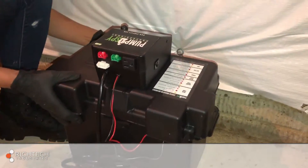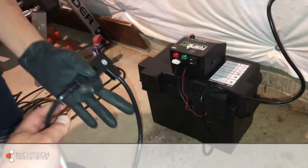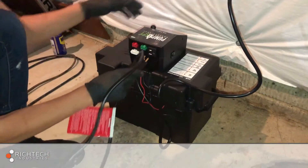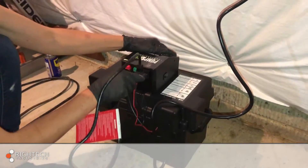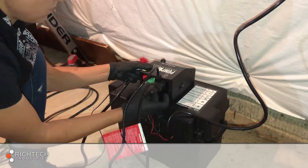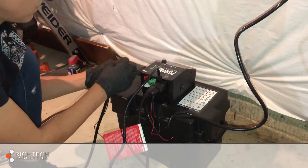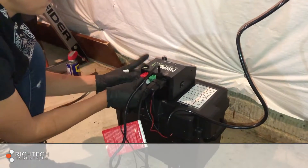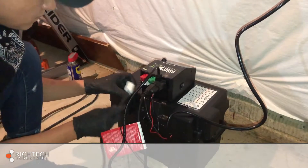Make sure you plug the primary pump with piggyback switch connection into the back of the PumpSpy controller, not into the wall. The connections on the back of the controller are also color coded for easy setup: green for the backup pump switch, red for the high water alarm, and white for the backup pump power.